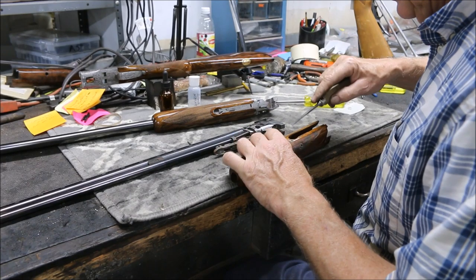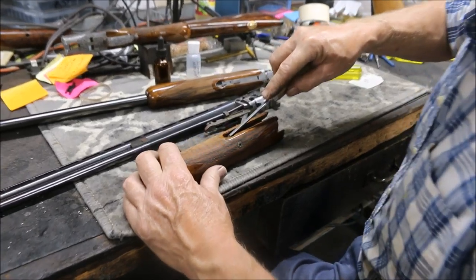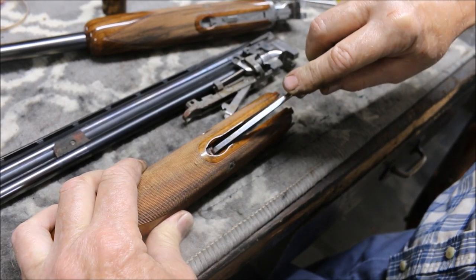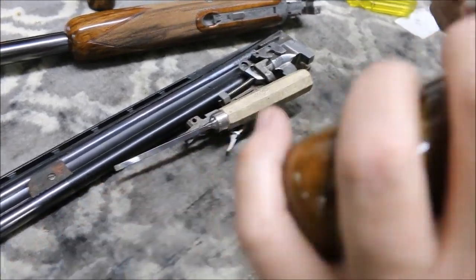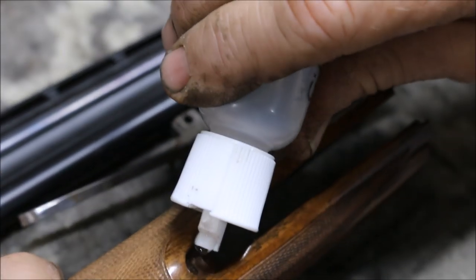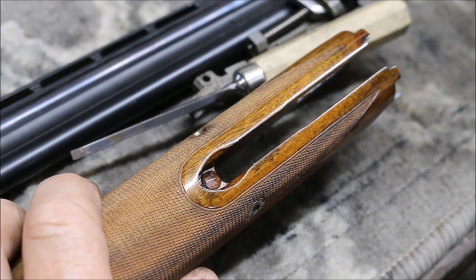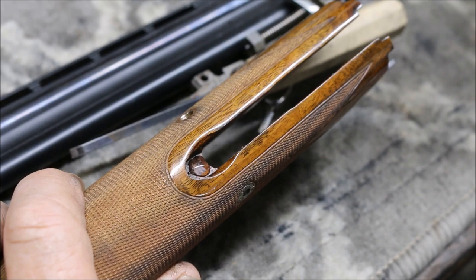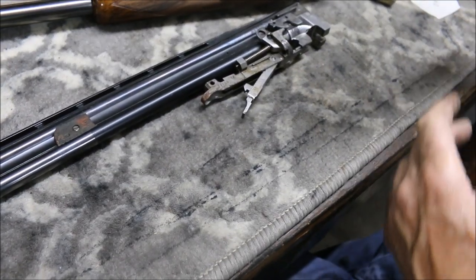I don't really need to do a chemical inspection on this — I can tell you it's salt. But when you check them for salt, get in the inlet and get your little chisel. You've got to get through all this finish and kind of chisel out a little bare spot, then drop a drop of silver nitrate on it. It'll turn white. If it stays clear or maybe turns black, it's okay. This one's turning white — not real white, real fast because it's a light content of salt, but it is turning white. So this gun has a salty forearm on the 410 barrels.